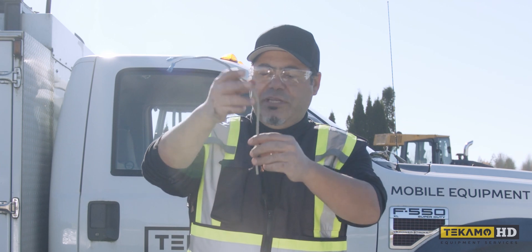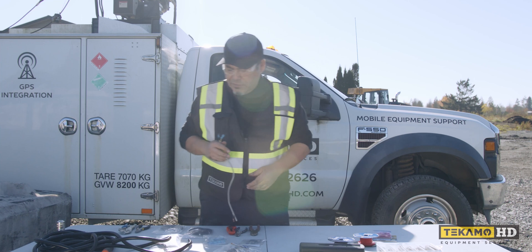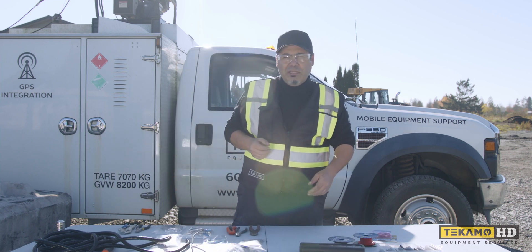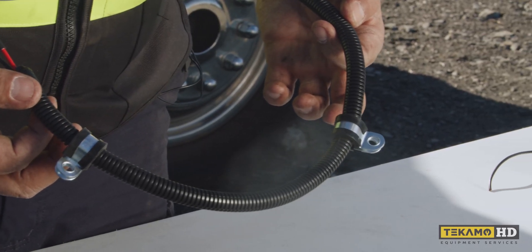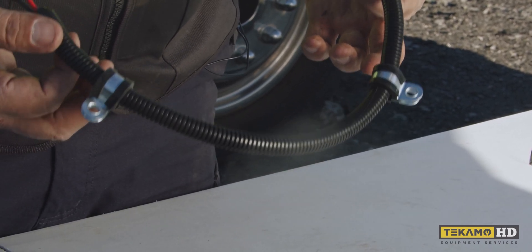This is the one that was actually cut between the box. We're going to make two new wires with connectors, and we're going to loom them and heat shrink them as well to make sure that they're well sealed. Even though it's a small piece of loom, a small piece of wiring, it still needs to look and represent a job well done.